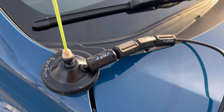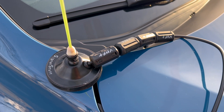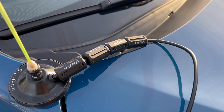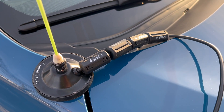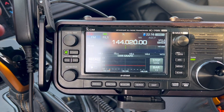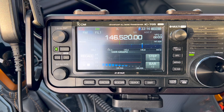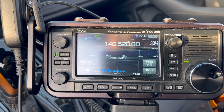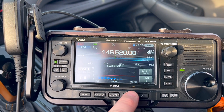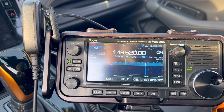These are really good quality ones from Palomar Engineers - designed for VHF and above frequencies. I've got four of these snap-ons on there, and I labeled them with a silver Sharpie so I know they're for VHF and above. We've got the chokes on - let's pull up and check the SWR quick. It's actually a little bit better. Well, I'll be dipped - always be choking! Now for the more important stuff, let's get out of there and embiggen the scope.